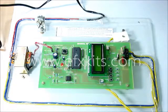This project is model number 9: integral cycle controlled AC power without generating harmonics. Integral cycle control is a method to remove portions of full cycles or one cycle of an AC signal for controlling AC power across heater loads or linear loads interfaced to a programmed microcontroller. This process of power control generates 1% THD — total harmonic distortion — compared to 61% with the firing angle control method.